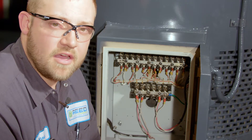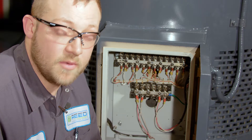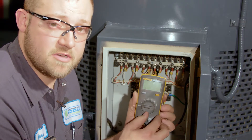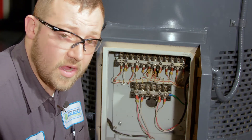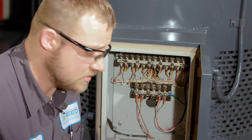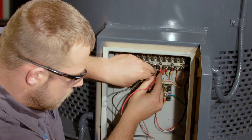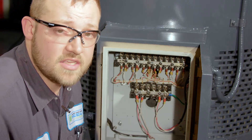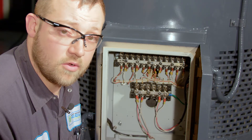Here's a way to find out if your RTDs are actually working. First, grab a multimeter. Second, set that multimeter to resistance. Then check both your winding and bearing RTDs. If you have a zero resistance reading your RTD is bad. For these 100 ohm platinums your resistance should be 100 ohms.